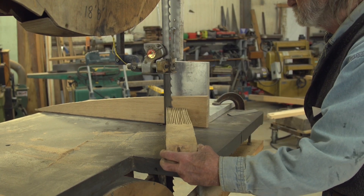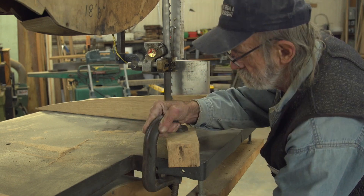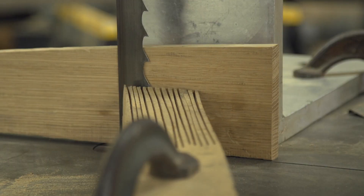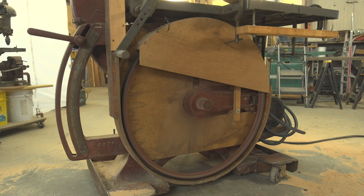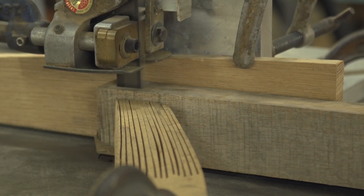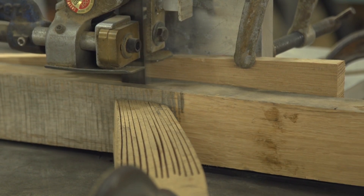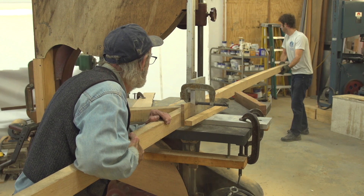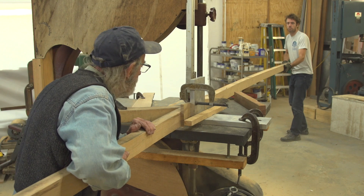I love using the ship saw to re-saw or do progressive sawing and all kinds of stuff like that. I rebuilt the whole saw — new shafts, bearings, all kinds of stuff. This saw is terrific. It's a special one because it doesn't have a slot in the table for the blade as you swing the bevel; what it has is a sliding table. So you can do progressive bevel ripping with this saw. This saw is really something — it's an old Crescent. I love it.